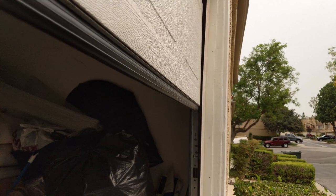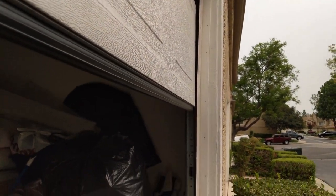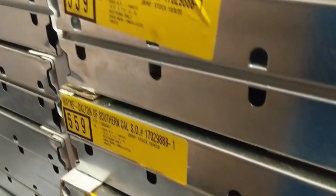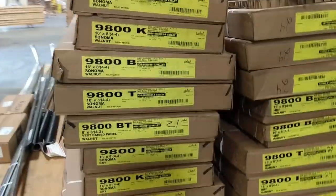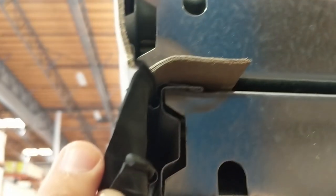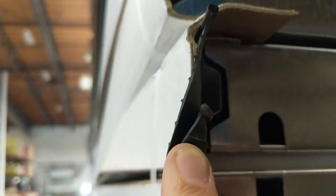You can use a hair dryer at a low heat to make the seal a bit more malleable. These Wayne Dalton door seals are not that wide, so what you see is what you get. That's the whole point about getting the right bottom garage door weather seal. The Wayne Dalton model 8000 follows the same principles when applying the same seal, but the retainer is a bit wider and thus a bit easier to apply.